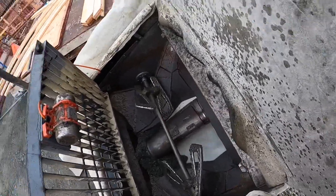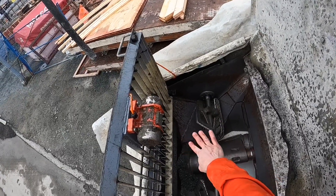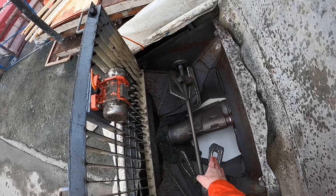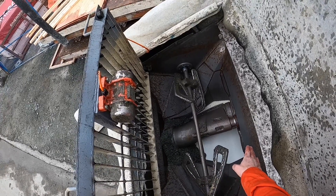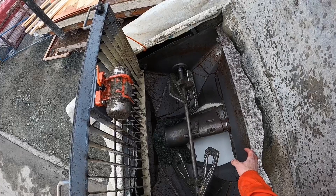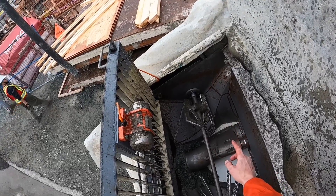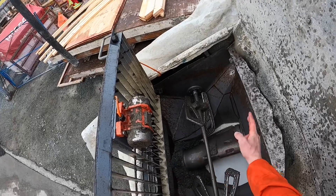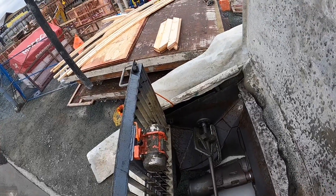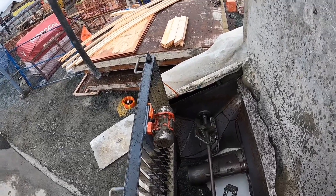When I fill the hopper, I'll put the driver's chute toward that side of the s-tube, let the concrete fill up that side, spill over the s-tube pushing the primer into the cylinder while the pump is stroking slowly forward, drawing the primer into the cylinder. Then I'll quickly interrupt and switch the s-tube over before any concrete gets in there, so the first cylinder is filled with just primer and no concrete. I'm also going to put the auger in reverse when the first bit of concrete goes in the hopper, just to pull that first rocky bit away from the cylinders rather than pushing it directly up.